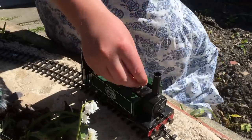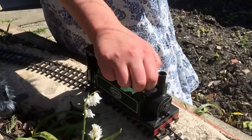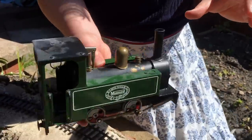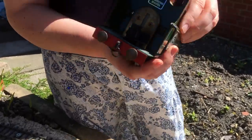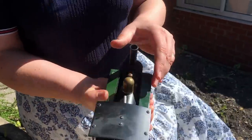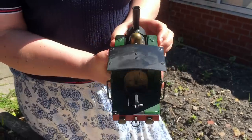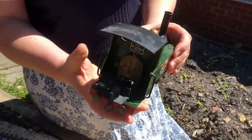This is, of course, ethanoic acid with some other stuff in to make it malted vinegar, and it's quite a weak acid so it's not going to attack the metal. Let's put the safety valve back in so it doesn't all leak back out when I turn it upside down. I can now feel there's a load in the boiler, just trying to get it to react with that scale. I can already see that some of that scale and horrible muck has come away from the sight glass at the back — it means I can actually see the level inside.